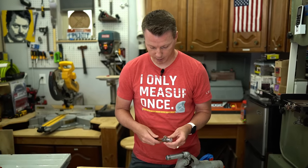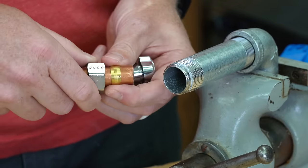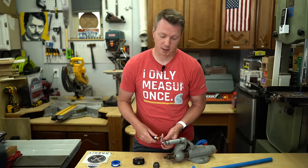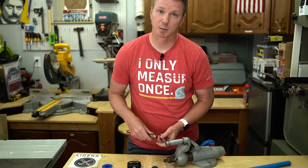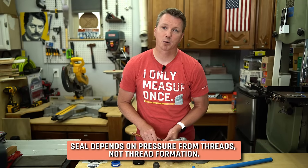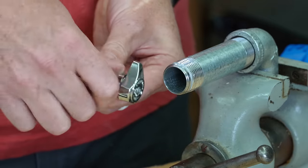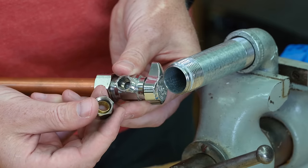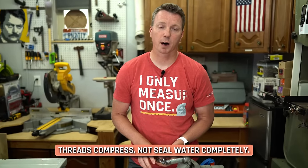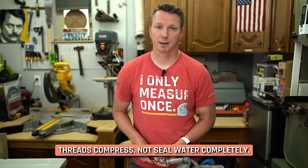Some parts are a little bit trickier. This little quarter-turn valve has a compression fitting ring right in here. That means we ideally shouldn't need Teflon tape on this either, since that ring is what's doing the sealing — it's not relying on the threads to form the seal, but on the threads to create pressure on that fitting ring. Same thing on the top piece — there's another compression sleeve in there, and the threads are there to clamp down on that compression fitting for a tight fit.